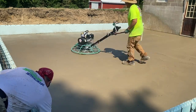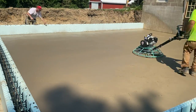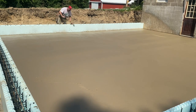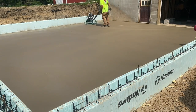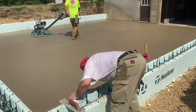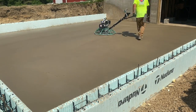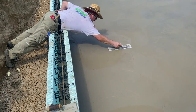Bronco's hitting that area that we ran short, pretty much hitting it by hand in there. I'm still trying to stay out of there because it was behind the rest of the floor. That's how easy it is right there, guys, when you pour them like this. I'm out here hitting it again — just let it dry a little bit more and then hit it again, switching directions with the power trowel. Let me know if you like the video, guys — leave me a comment, good or bad, it'll help my channel. If you're not a subscriber, look at my channel, I got a lot of good stuff on there. You should subscribe.